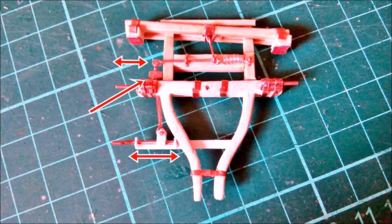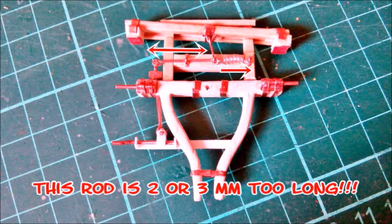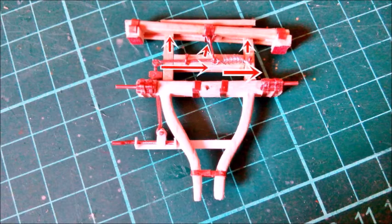And now for a bit of theory. Moving the actuator to the right by rotating the crank moves the rod that's connected to it to the left and vice versa. The guide converts the motion and serves as a pivot. The actuator glides forward and backwards in the guide. Rotating the crank into the closed position pulls the two rods and the brake forwards to the wheels. Rotating the crank into the open position releases the brake and the spring pulls it backwards.